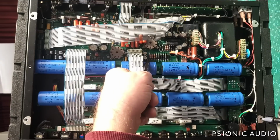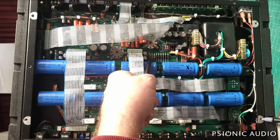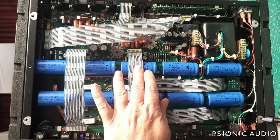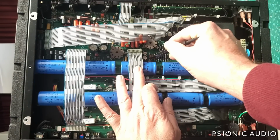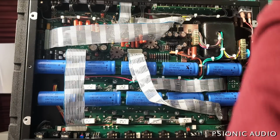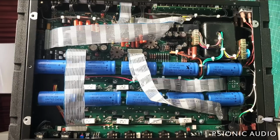This is a 15K 3/4 watt. I think I see 106 beneath it. Mesa always has the part numbers beneath the component, but I don't know whether this is actually R106, or whether they just use a 15K in this model versus the 10K in the Prodigy. So the first thing I want to do is check continuity.